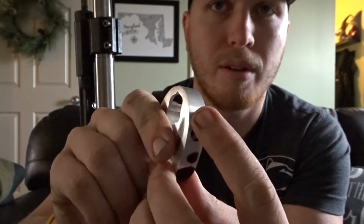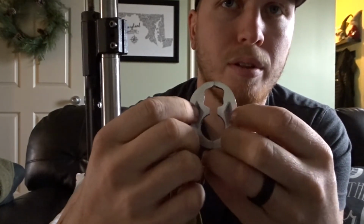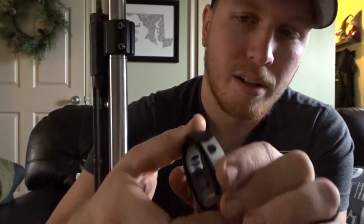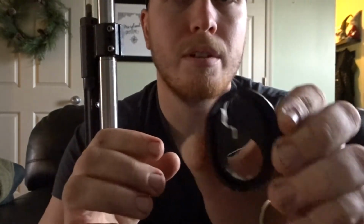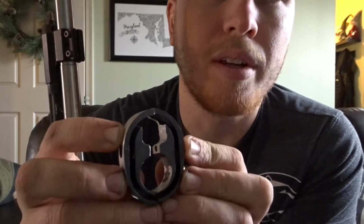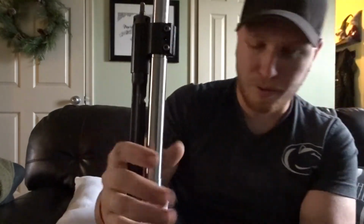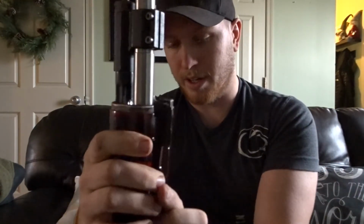I got them on my belt sander and ground them perfectly flat, and then ground everything to the same depths. And there must be like 2 little low spots here from machining because that finish stayed on for whatever reason. But they are perfectly flat. They are perfectly sized in my opinion. You can see, hopefully, need a proper light. There is a slight bit of more material at the top, but nothing that I'm concerned with. They fit very well, and I don't want to screw with it anymore. Don't fix what isn't broken. They aren't broken. They fit perfectly fine. So that's good to go in my book. The handguards slip right on, fit right in.